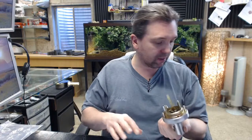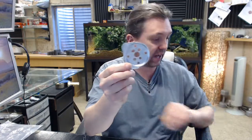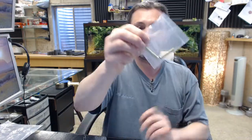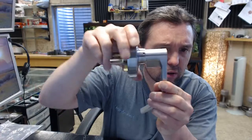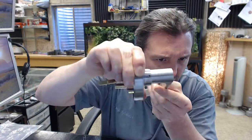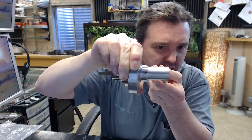This model is a little bit unique. You're going to get a plate, and that plate is for installing it onto the door — the flat end goes towards the lock edge of the door. You're going to get two screws for going through these holes into the tapped hole posts. You're also going to get a small pin, and that pin is to remove the lever. The access point is right there.